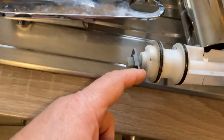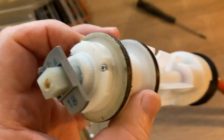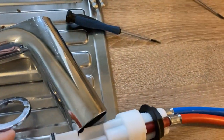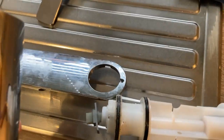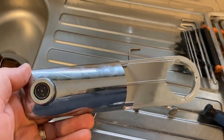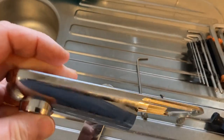I have to throw all of this away because none of it's any good - apart from the cartridge which is in here. There are a couple of Torx screws to take out, which reveals the cartridge. I had to replace the whole tap just because of that one crack. These two pieces slop back together, fit the end back over, screw it up - job done. Come on Reich, make spares available for the general public who want to repair taps rather than throw things away.